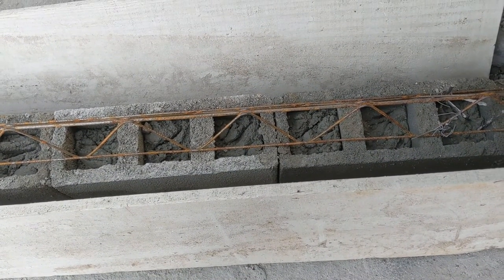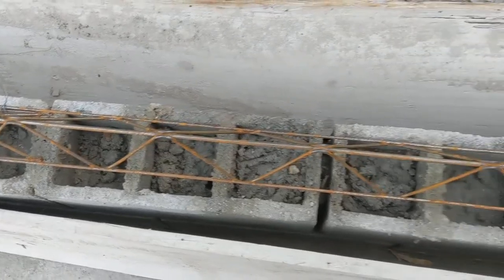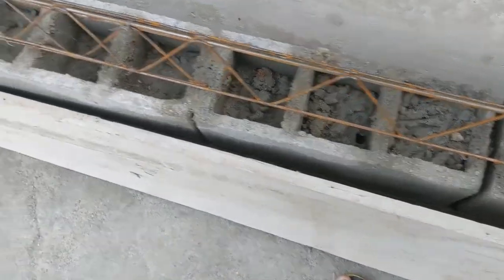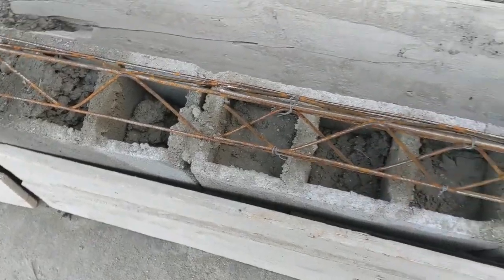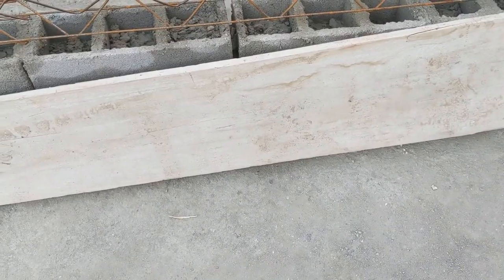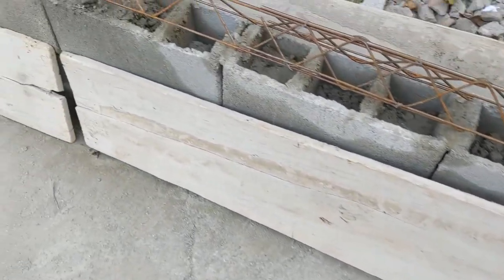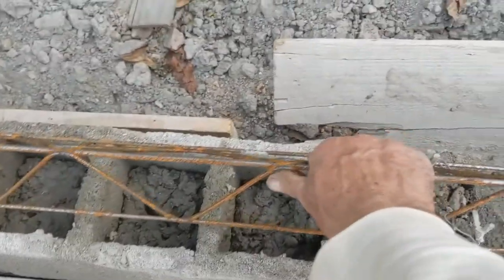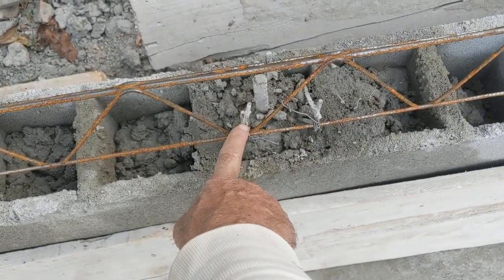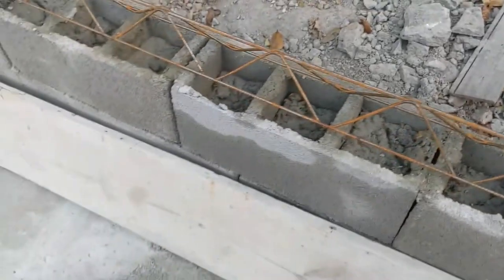My retaining wall is pretty much up, just gonna do the top here. The blocks are all filled with concrete, and we have the truss in here. We're just gonna fill it up with concrete. We have the board in there to make a form, fill it in with concrete, and it doesn't move — the board is tied up. We have a rebar and another piece of truss coming down, all tied up. This is strong.